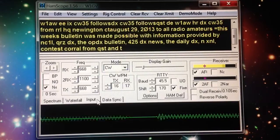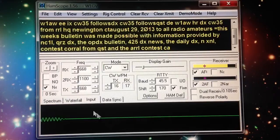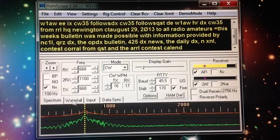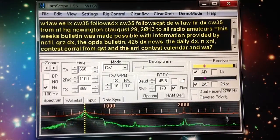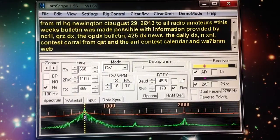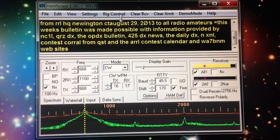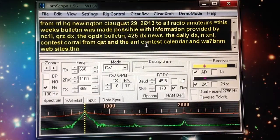It'll also show the input. I don't know what good this really is, except as an audio oscilloscope — makes a good audio oscilloscope. Kind of neat looking, but the most useful that I have found here is the spectrum. You can see there's a little bit of distortion in my audio system here. There's some harmonics of that audio tone at 668 hertz. But there you can read what they're saying, and that's exactly right.